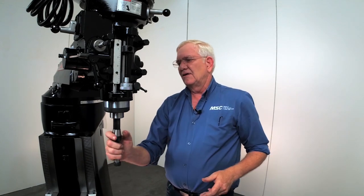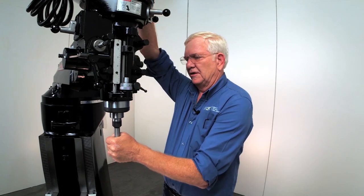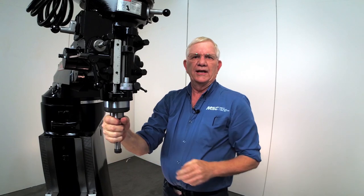The purpose of that collared alignment screw is to keep the collar from turning when you hit the drawbar that's on top of the machine. Sometimes they get smashed, they need adjustment, whatever happens.